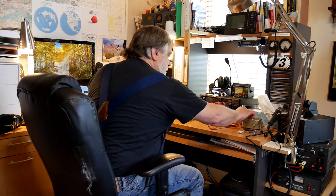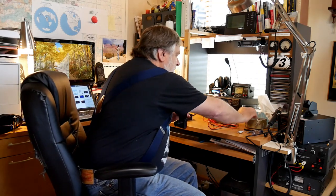Where do you get one? They're available from MFJ and from quite a number of independent producers — each one will tell you their balun is better, but they do about the same thing. And can you make them if you have a toroid core? Absolutely — you can wind them with some good sturdy wire. The toroid in this one right here is just simply huge, so if you have a toroid like that, you can try to wind your own, just like the voltage balun schematic I showed you earlier.